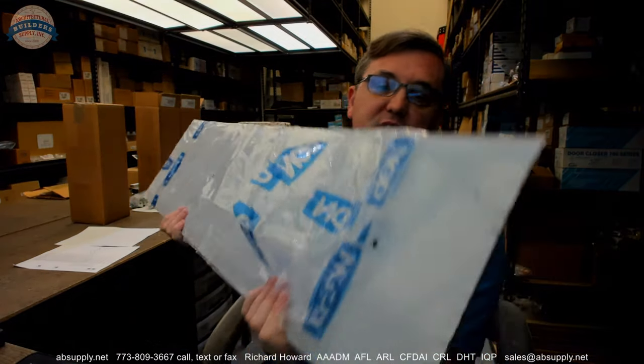This material is solid stainless. This will be shown in the mill finish. Other finishes are available, but if you don't specify, it's going to be mill stainless. There won't be any brushing, polishing, or any additional process done to it like bead blasting or a surface-applied coating, or what National Guard would call SIA, which stands for Slick It Ain't, making it substantially slip resistant. So be mindful: unless you see a finish in the part number, this is going to be a mill finish piece of equipment.